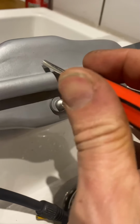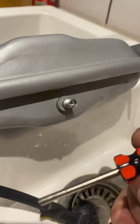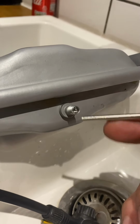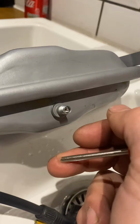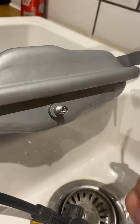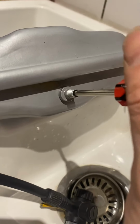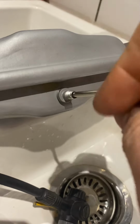So what will happen is, as you turn your heating on, and if this hasn't got any compressed air in it, you'll find, if you watch your pressure gauge on your boiler, it will slowly start to just creep up, creep up, creep up. And then it'll activate the pressure relief valve, which is usually set at about 3 bar. So then outside you will have a pipe, which is usually set back against the wall, and it will spit water outside. And then when your boiler cools down, you'll find that you've lost all or most of the pressure in your boiler, and your boiler won't work, so you've got to top it up again, and it will keep repeating that process. So by simply replacing that little insert there, we can hopefully stop that small leak coming out of your expansion vessel.